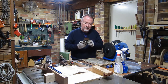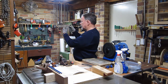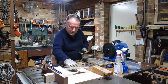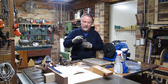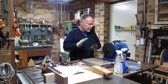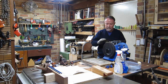With the cap iron off, this blade is actually not too bad. Holding the square up to it, it's almost spot on 90 degrees. However, the edge of the iron has obvious rust and damage on it, so that's got to go. I need to grind it right back until I've got a perfectly flat surface and I'm into new metal.